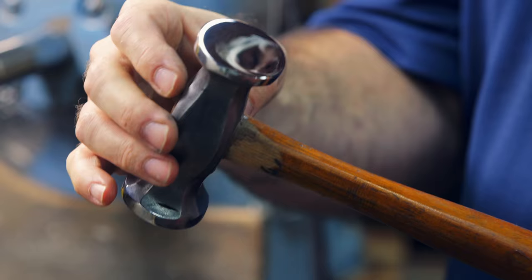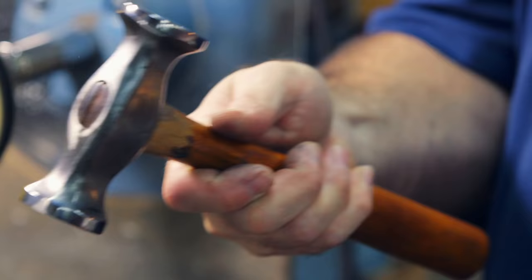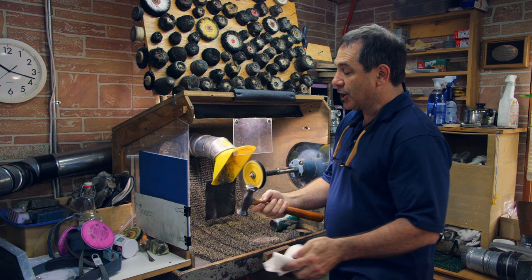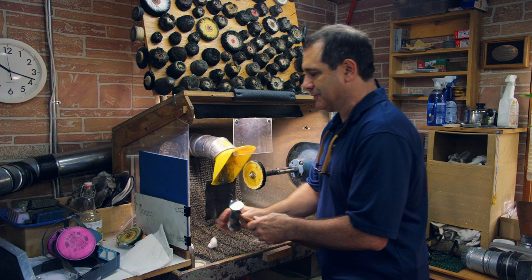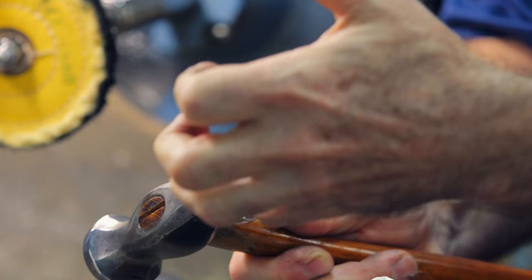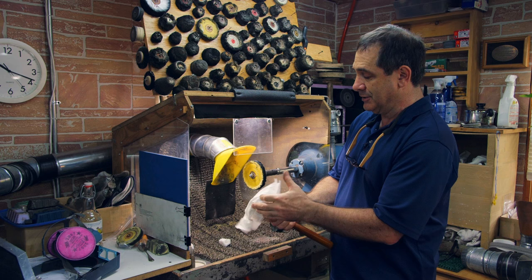Now look at how beautiful the face of that hammer is. Another reason for keeping your hammers looking really beautiful is that you'll want to use these hammers. This should be part of your weekly, monthly, yearly maintenance — taking care of your tools and making sure that they're always in tip-top condition. So now I'll apply some carnauba wax, which is essentially a bowling alley wax. This is a little on the hot side because of all that surface friction. Normally I would let it dry and then buff it off with a paper towel, and then you'll be able to draw your fingernail across and see how slick it is. This is going to last a long time while it's in your hammer rack. That's how you refinish a hammerhead.